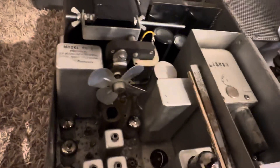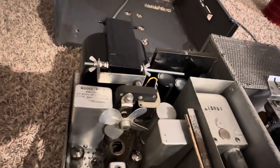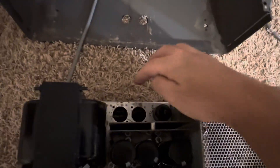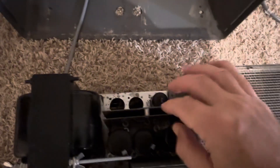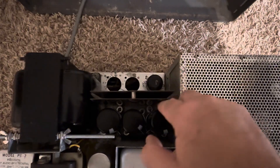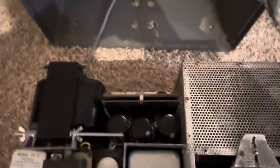This thing has like 27 tubes in it. I don't think you can run that all off one transformer, but I could hook the Tempo 1 up to half the tubes and run another transformer for the other half. I could probably fit a 12 volt or a 6 volt transformer for the tubes right here. Take out the shield — I've had this shield in here as a blast shield, in case these capacitors blew up. So that's my dilemma here.